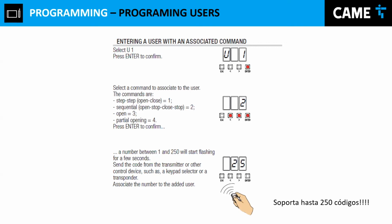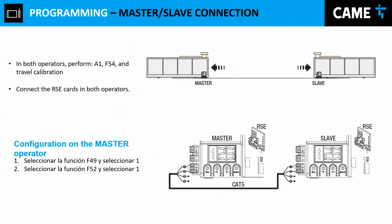Let's say, for example, I want to use open close. And that one means that it's going to be the first remote control. It's going to be programming. You press the button. And right there it says stop. Stop means that that button has been stored in the memory. So you already programmed your button for the remote control. You press your remote control, you test it, it does a closing cycle, and then it will do its opening as well. So that's for the remote control. And see right there, we set up the automatic closing for the device. We set it up before at 17 seconds.